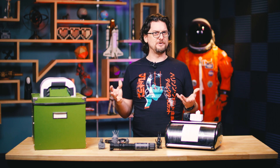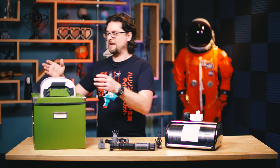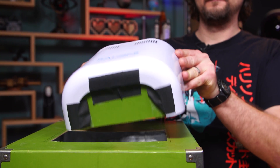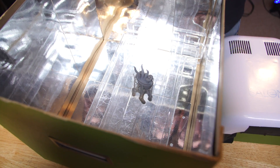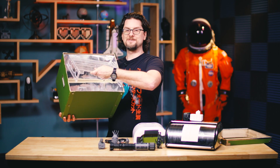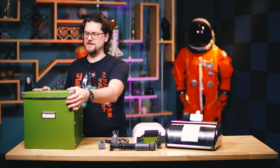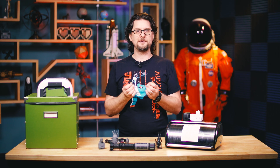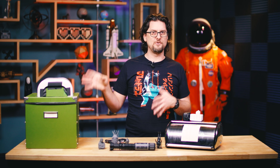Initially there wasn't really much out there — you kind of had to do your own thing. Formlabs actually put a video up about how to make your own little UV oven, and that's what I've been using since the beginning. That was simply a nail salon UV cure, which you can get on Amazon for under 30 bucks. It has UV lights that shine down into a box where you place your prints. In my case, I used an IKEA box with the top cut, reflective craft paper inside, and a little clear riser to allow light to bounce up from the bottom and get to the bottom of the print. Sometimes people also put a little solar-powered turntable in there. It worked, but it was a bit clunky, and the nail salon cure is not at the optimal wavelength of UV light, so it might take two to three times as long to cure prints.